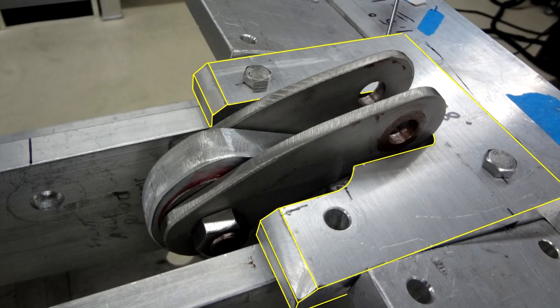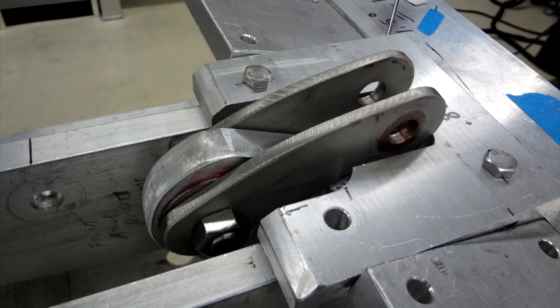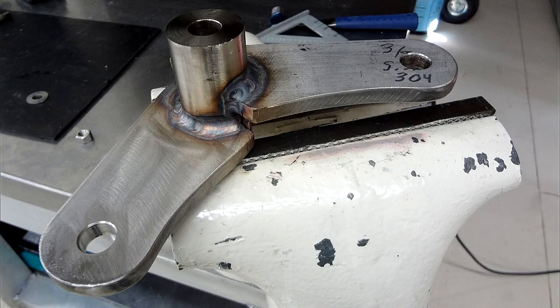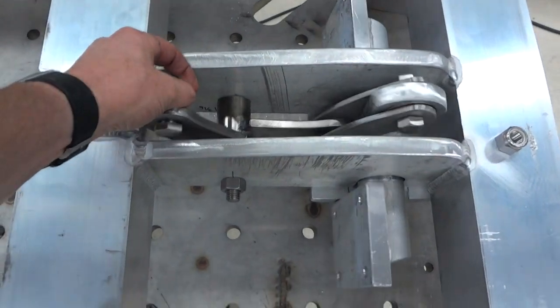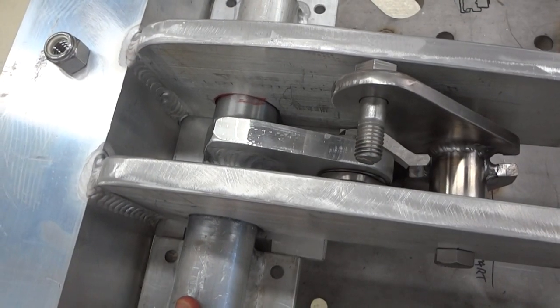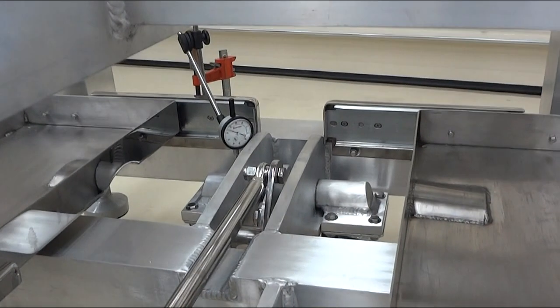Once installed, a stop pad holds everything in when the wheels go airborne, and then twin stainless connector plates bring the signal in from the bell crank. Together, they reverse the throw so the wheels fold into each other. Then for suspension, it'll tilt 2 degrees, and you can see it working with the dial indicator.